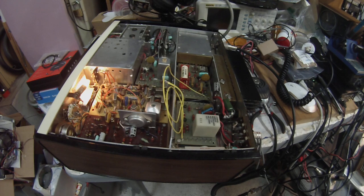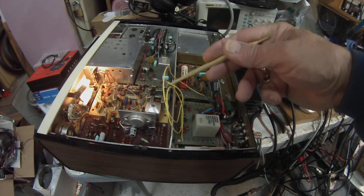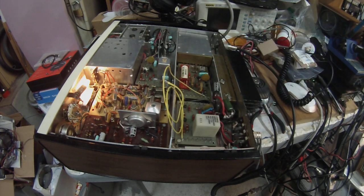Knowing how it was connected, I simply jumped 12 volts in there, which would give maximum gain while I awaited replacement bulbs. Finding what's called a grain-of-wheat bulb — a little mini light bulb, 6 volts at 50 mA — I looked all over and finally found them at All Electronics in Van Nuys, California, so I bought several. This morning I just jury-rigged it in, running a jumper wire from 12 volts to the ALC light pin.